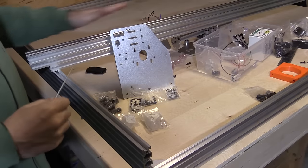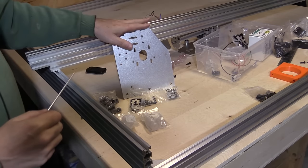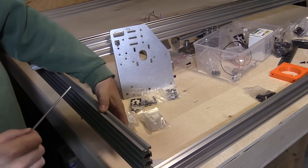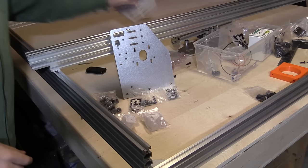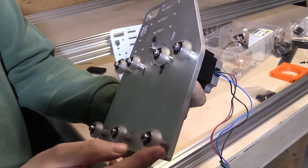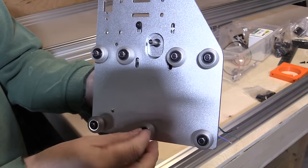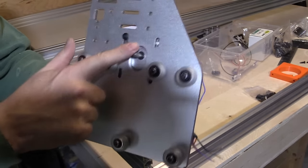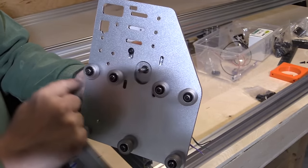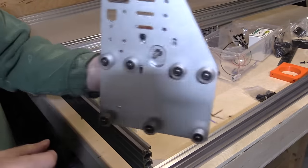The gantry — which is these three pieces here — needs plates on either end. It'll have a bunch of wheels put onto it so that it rides along these rails with wheels on the top and bottom to make contact and keep everything nice and stable. Here's one I've already built up earlier. You can see we've got these wheels with two bearings on each one — three at the bottom, four at the top. This one already has the stepper motor mounted in here, and there's going to be a toothed gear with a belt running underneath, up over the gear, and back out again. When the stepper turns, it will drive this up and down the gantry.